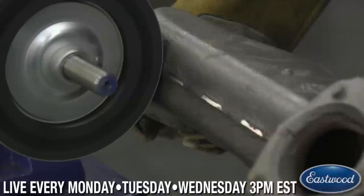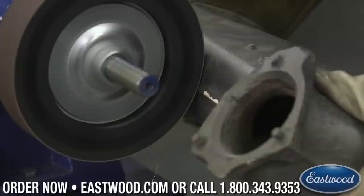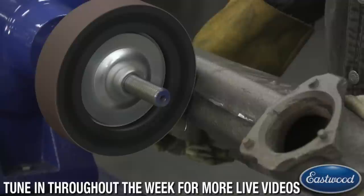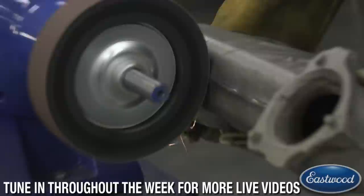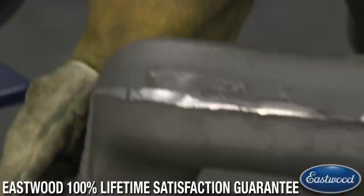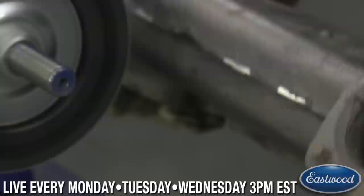I'm just working it around here on the cast iron manifold using 80 grit. I can push pretty hard on it — you can see how it deforms. We've got the buffer bolted down to the ground. I can push pretty hard and you can see that section I just hit there really knocked it down. It's not gouging into the metal and creating low spots; you're actually pushing into the expander wheel and it causes it to knock things down, which is cool.